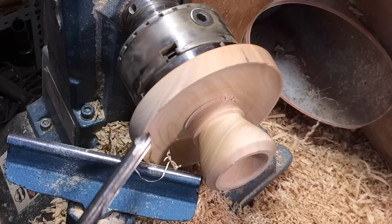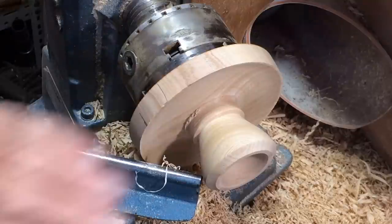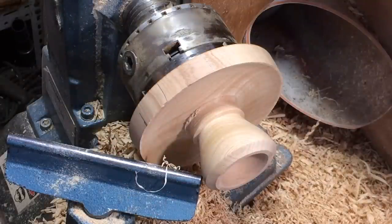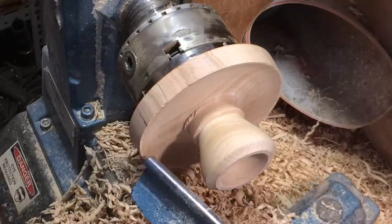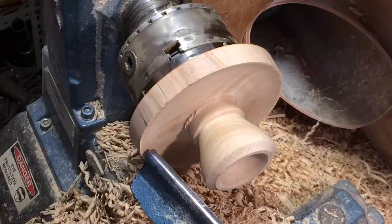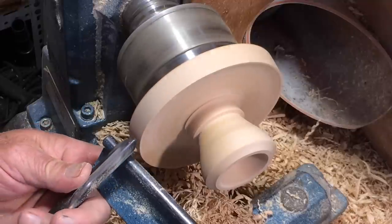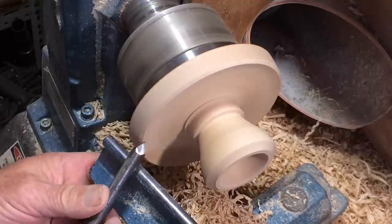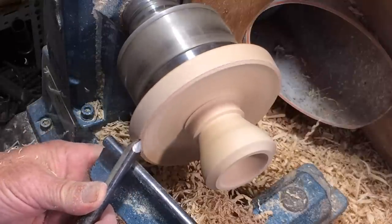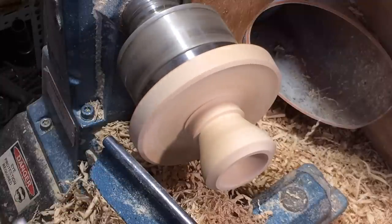and it's chipping a little bit on the rim because it's very thin, but just chamfer that, will take care of that. And then around here, it's beginning to be a little bit difficult to get in there, so we'll take this bit away first, give me a shade more room. Oops, should be going that way. This is the grain going cross grain, going from larger to smaller diameter.